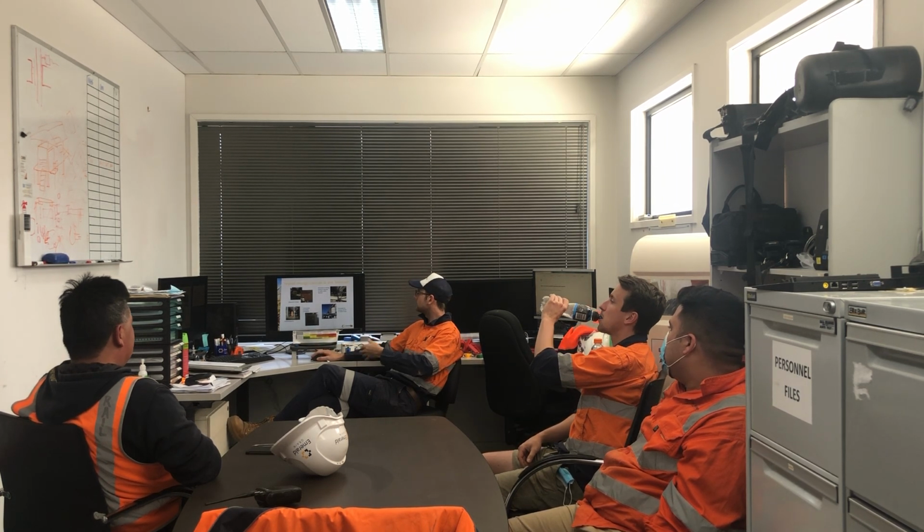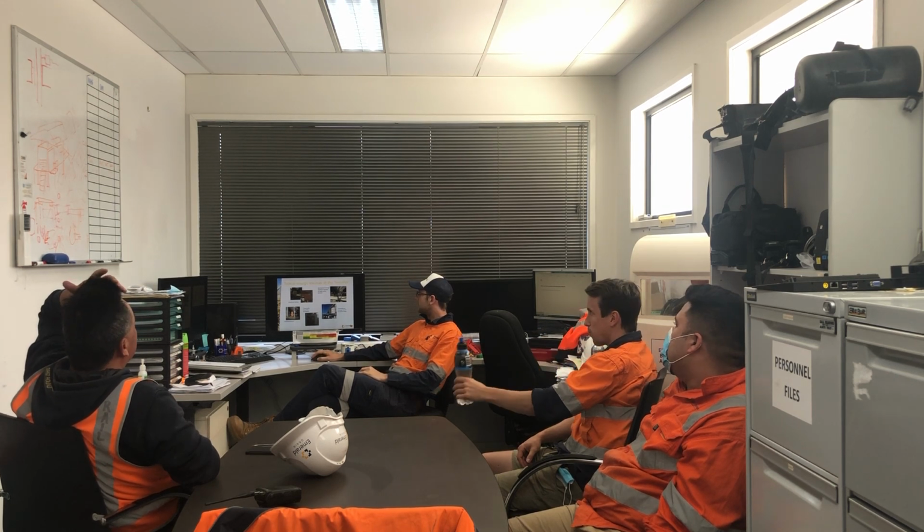Okay. Here's a couple of examples of some energy sources here on site. So electrical energy, so any time we're turning a switch or a circuit breaker or going inside one of these orange cabinets, that's going to be an electrical isolation because we're isolating the electricity from the motor or from the drive or from whatever it is. Mechanical energy, so there's these silo valves, so they've got little screws inside them and they're under a bit of pressure from the motor. So mechanically, that drives forward, and you get your hand stuck. It's probably going to chop your hand off.